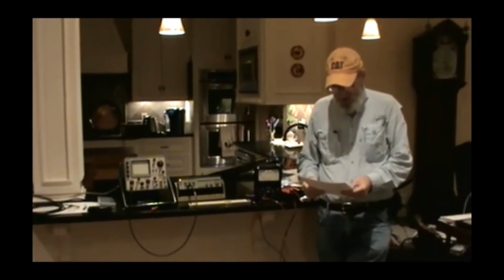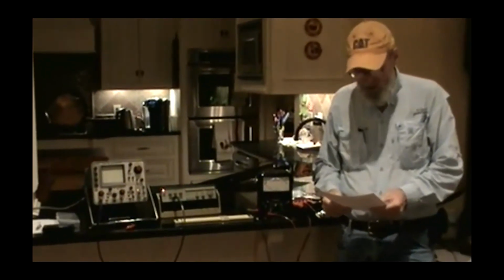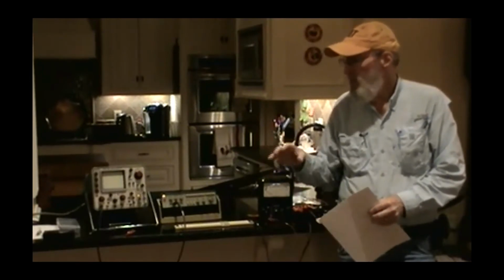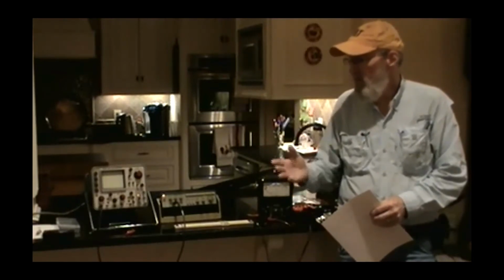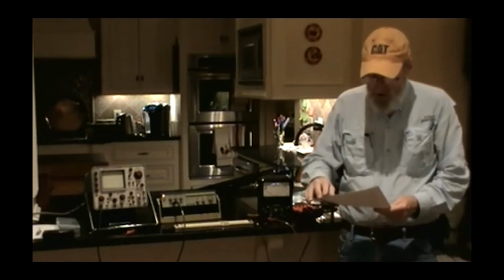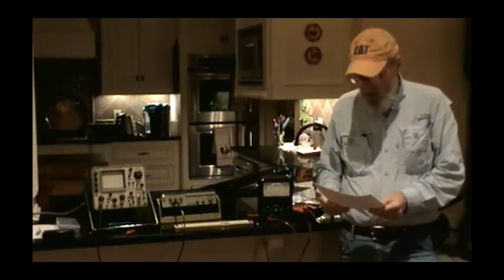Let's see. As we said, on the digital scopes, you have auto setup available. Accuracy is extremely good, and you have cursors. You can actually scroll back and forth, put cursors on the screen to measure time, measure amplitude. Some of them offer differential measurements. It's a nice feature. As far as scopes using the ham shack, obviously repair of equipment, monitoring transmissions.